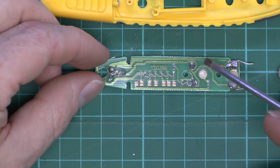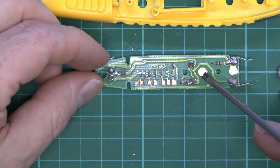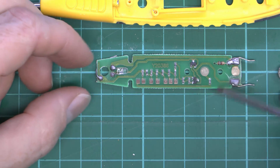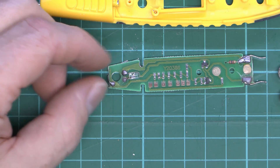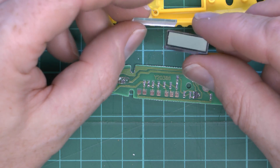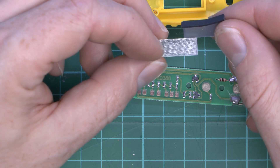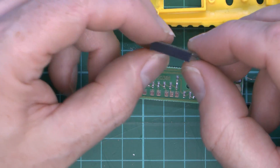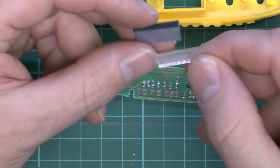And again as with the other one, bearing in mind there's not a great deal between you and the mains voltage. These are the pads for the two little buttons on the front. So you're totally relying on the actual circuit board track clearances, and of course whatever resistances are in series with you and the mains supply. The crystal display is the same as before — little zebra strip on the back. And then there's a bit of random plastic here which is just being used as a spacer, obviously a bit of waste cut out of some other panel.